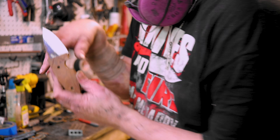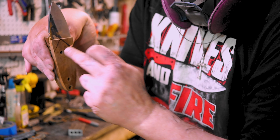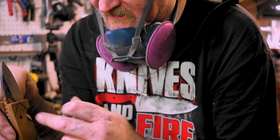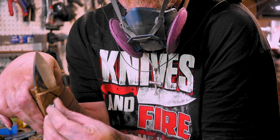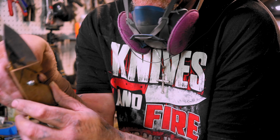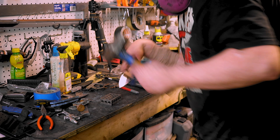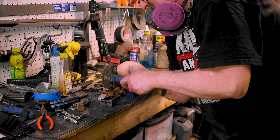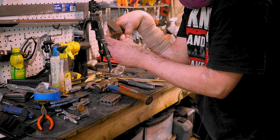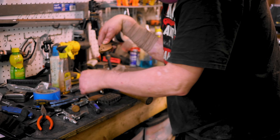Don't hit the pivots. Put the screw in and get longer screws so they knock out. Use the one-two-three blocks. Then you can hammer on the pins — make sure your holes are over one of these holes on the block. See, pins come right out. Unscrew the screws. Boom. Your pivots are off and they're good. Then you just put them together, put the pivot back in, and put them together.